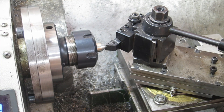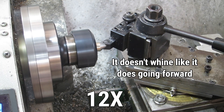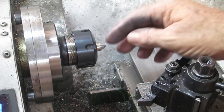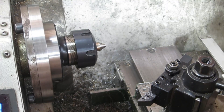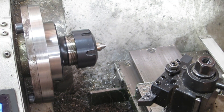I was planning on making this a 45 degree point, and I set out to machine it to 45 degrees, but I've decided it's not pointy enough so I've changed it to 30 degrees. I'll finish this off now. And I made a startling discovery - this thing runs quieter in reverse than it does forward. I think I might leave that little tiny tip but still at 45 degrees. This is a piece of stainless in keeping with the rest of it, so I might polish that up a bit. One thing I'm not looking forward to is trying to part this off because it's a long piece. I was going to make the stem from 10mm but I've only got the one piece of 10mm and had two or three bits of 12mm, so that's a bit of 12mm round.